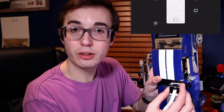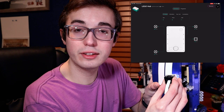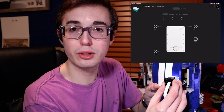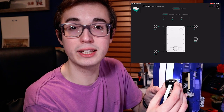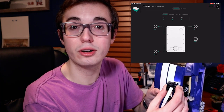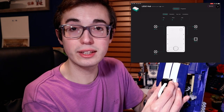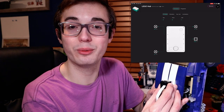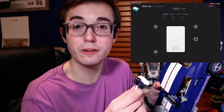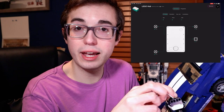To demonstrate this, I'm going to use my LEGO Mustang, which is a great example because it is a dark blue car with some nice bright white racing stripes. If we shine the sensor on the dark blue part of the car, we can see that the reflected light intensity value is relatively low. It's not super low though, because the surface itself is a little bit shiny — shiny surfaces do tend to reflect a little bit more light even if they're dark. By comparison, if we move the sensor over to one of the white racing stripes, the reflected light intensity value is now much, much higher. This is how competition robots for FLL and WRO are able to track lines and designs on their competition mat with a sensor aimed downward.